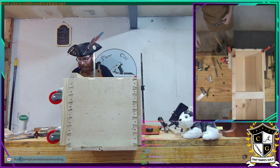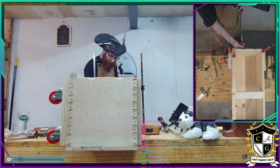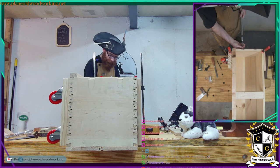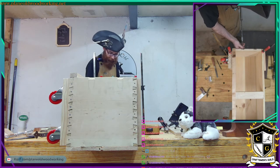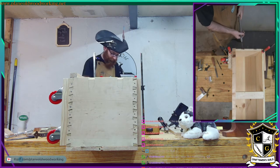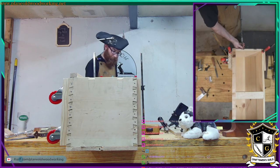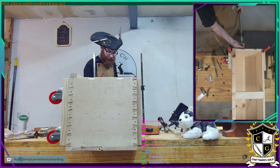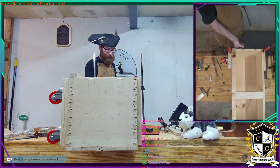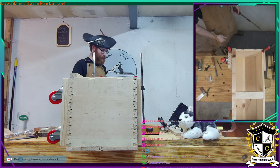Okay, just a small bind. But you typically want to let a steel screw cut through the wood first. There we go. Just because they have a tendency that if they get stuck, they will shear right off and then you can cry multiple tears. Lock it so it stops doing that.